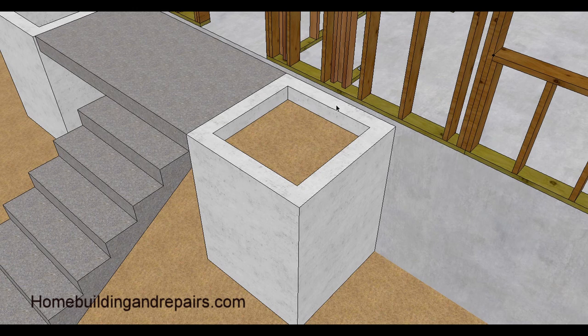Something else you could do is provide additional materials to create some additional mass — to make the moisture a little tougher to get through. If you had a 12-inch thick concrete wall you're probably never going to have any problem with the foundation — it would take a lot of moisture to absorb through. But don't waterproof both sides. Don't waterproof the wall up against the foundation and the planter, because this would allow moisture to get trapped in between the waterproofed areas. That wouldn't be a good thing.